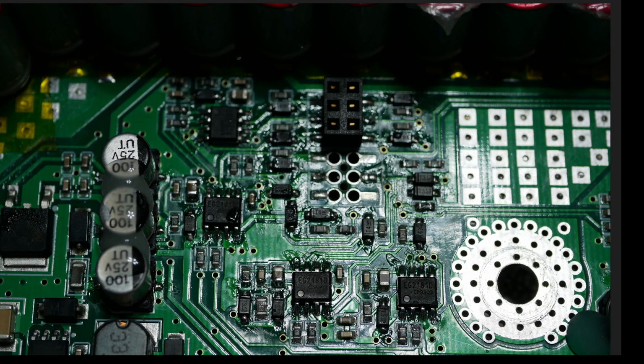In fact, let's look at that solder pad right there. You can see how badly crushed it is. Yeah, that screw was massively too tight. There's only one explanation for that, and that was a gorilla basically cranked on that screw and just really wrenched on it way too tight. And that's the one, by the way, that sheared off the stud. And now you can see why. It's because, well, it was way the hell too tight. All right, let us move on to the next picture.